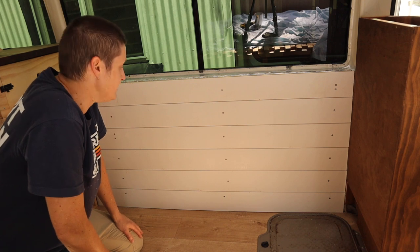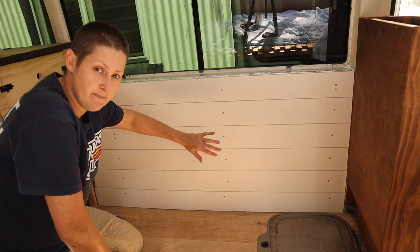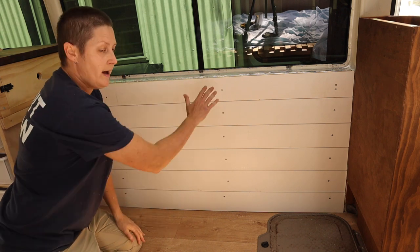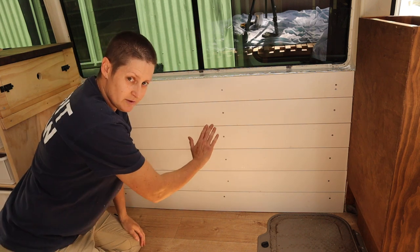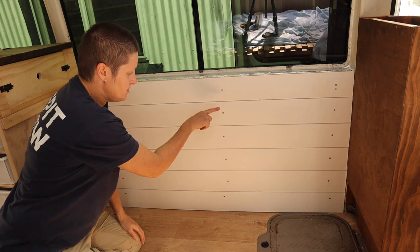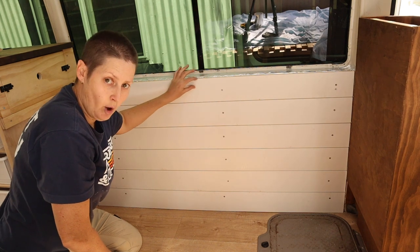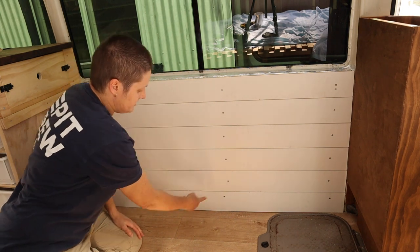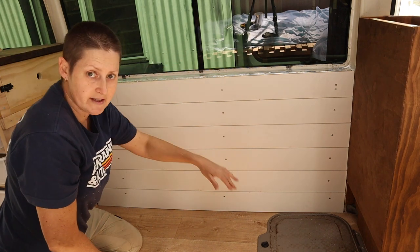The wall is lined. The next thing is to put in three vertical studs on this wall — they're going to be the main supports for the brackets holding up my special thing under the table. Because of the way the wall angles out from the floor up to the windowsill, I need the studs to be square so I can attach right-angle brackets to them. I've worked out that attaching a piece of 19mm thick pine at the top will bring it out in line with the bottom so the studs will be square.